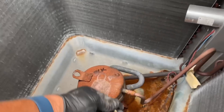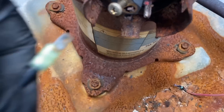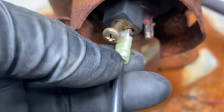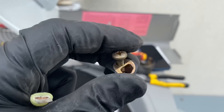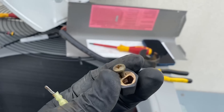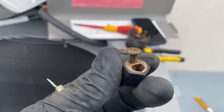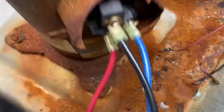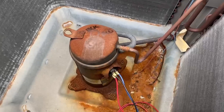These are the little lugs — they slide over the terminal like this, then you stick the wire in. Tighten up the screw and it secures the lug to the compressor terminal. What's great about these little lugs is that even if there's just a little bit left of the compressor terminal, you're still going to get it to work — nice piece of brass or copper. I'll post a link in the description box at supplyhouse.com. I got all three terminals installed.